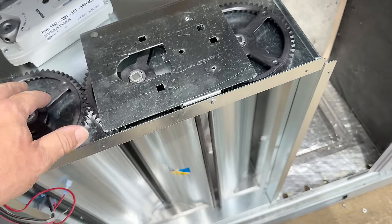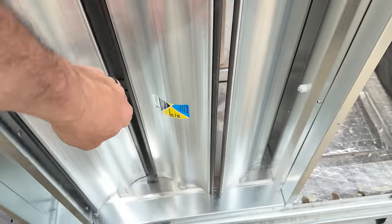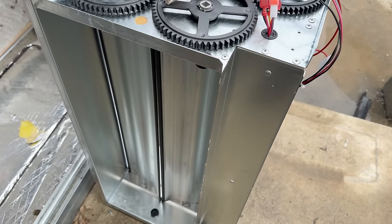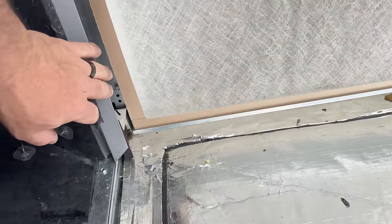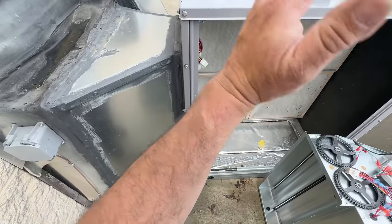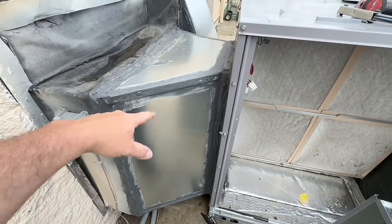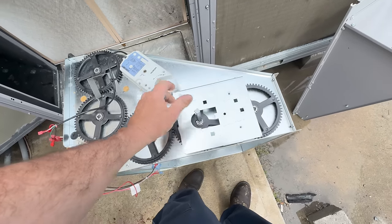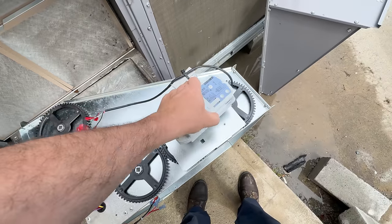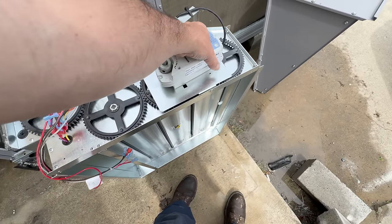The unit wasn't going anywhere — a couple screws would be good enough. Make sure it's not twisted left or right and not twisted front to back. These things have pivot points throughout. You can see how it gouged into it. It was looking really slow when operating. The economizer wasn't screwed in properly — there are crooked angles and pieces getting hooked in between the frame. Once I got it to the closed position, it turned nice and easy. I hooked up the actuator — spring-shut means powered-open.